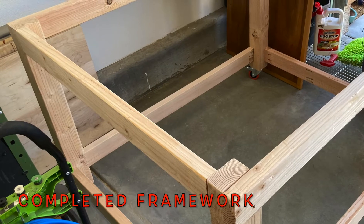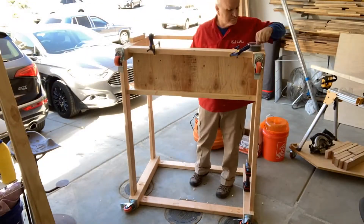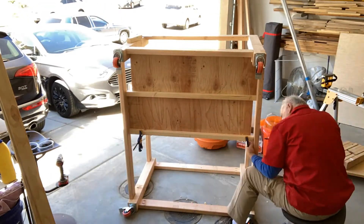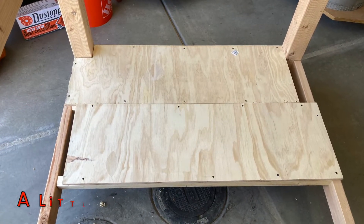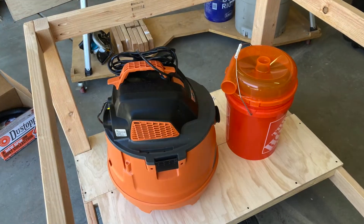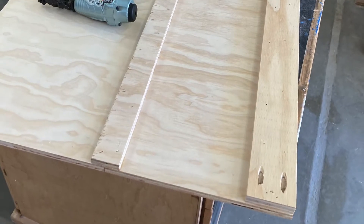You drive some good screws in there and piece it together — here you can see how all the construction works. I had a whole bunch of scrap pieces from another project a couple years ago that had just been taking up space, so I decided to use all scrap wood. We wound up with gaps on both sides, and I knew I was going to put the vacuum in there, so I needed some sort of breather system, because you can't leave that machine enclosed — it will get way hot and you run the risk of fire.